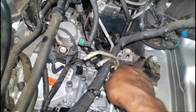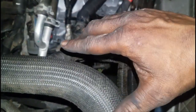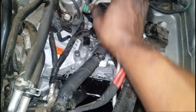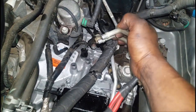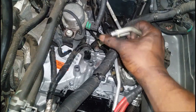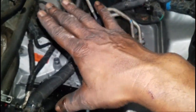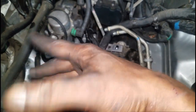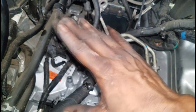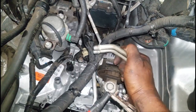That car will be back. If the cooler is housed inside the radiator and it's restricted, you would essentially starve the transmission and burn up the new one you just put in. Transmission coolers have to have flow. The machine we use will heat up the transmission fluid and flush it out both ways. But some newer cars use a one-way check valve, so you can't use those machines anymore — you probably need to get the new machine if you're doing transmission work. I'm going to show you a quick, not-so-professional way to at least verify that the cooler is not restricted.